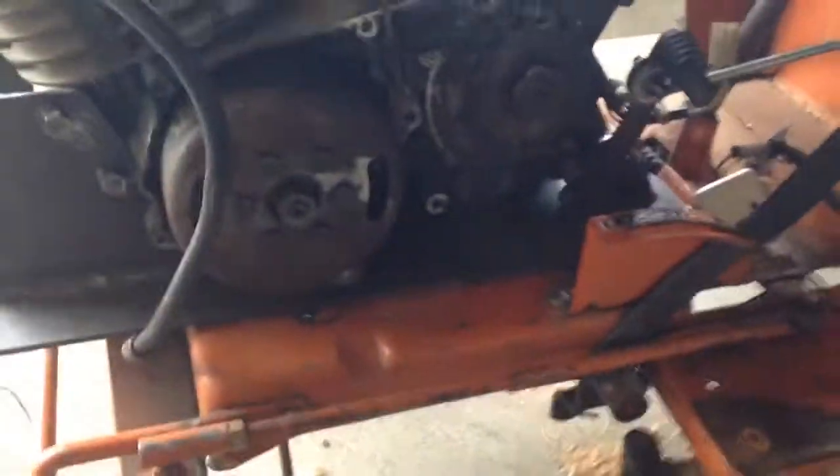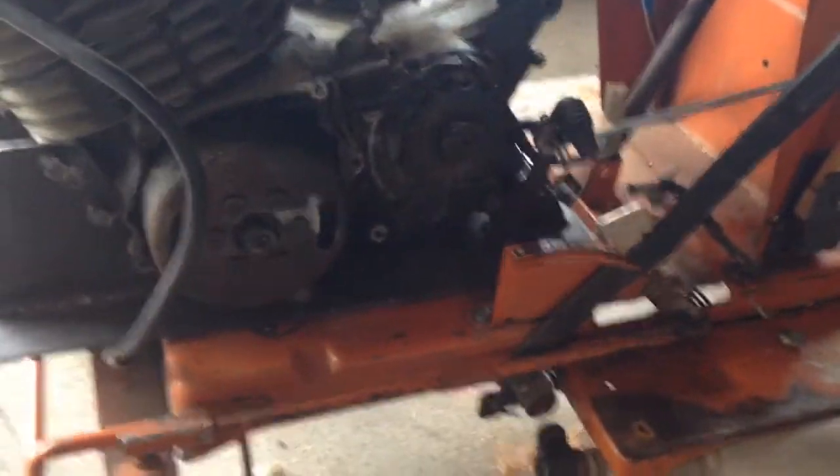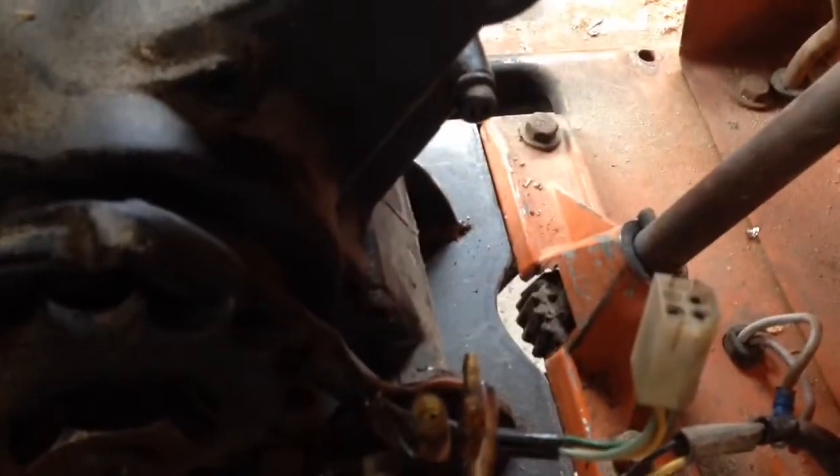Sitting on a 3/16 inch metal plate with the mounts welded to the plate. Yeah, I know it's not mounted the greatest, but we don't have room to fit this monster motor in this tiny little tractor. The mount is literally almost, it's got like 3/4 of an inch room to the steering column bracket. What we're gonna end up doing is making a mount, welding a bar on here. I'll go up there and you can bolt it down.